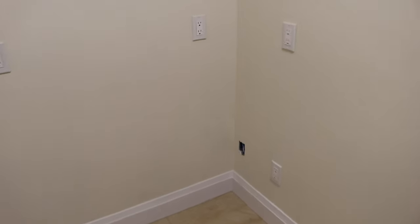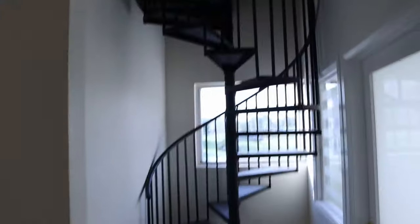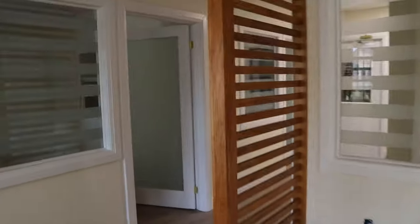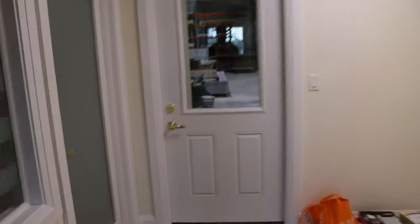This is how the offices look. We have a face plate that's gonna go on there. We have to terminate the Cat 6, and pretty much every office is kind of the same. We got some more Cat 6 there, and a couple drops that we need to do in this room. We have a few more drops, and then up in this ceiling we have an access point going somewhere. At the front door there's gonna be a camera. We have a couple other data terminations to do — one for the back wall, and then for upstairs. What we're gonna work on right now is getting the rack put up, cable combing all the cables, making it look neat, and getting the rack terminated.